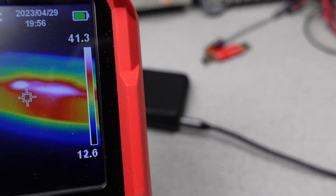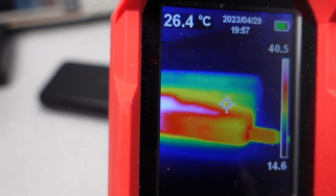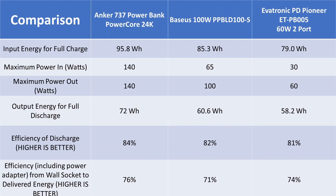The thermals on this power bank during both charging and discharging stayed fairly stable — around 45 degrees C in discharging mode at the full 60W level, and much lower during the 30W charging cycle. This is good to see. In terms of marketing claims, this power bank meets the basic requirements claimed. The claims don't account for inefficiency in charging cables and the actual charging circuit of the phone, so real-world performance will vary, but the numbers look accurate with about a 10-15% buffer included.